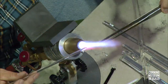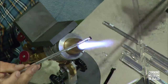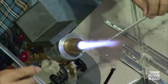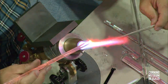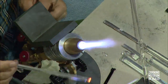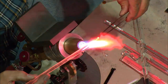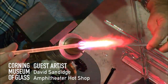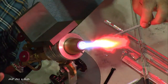You're probably going to want some graphite plates for your tabletop. You definitely want a fire retardant tabletop. This is just Hardiebacker concrete board. Doesn't take a ton of money. You're going to need some regulators for your gases. Those are maybe $100 each, one for your gas or your fuel, so either propane or natural gas, and you'll need one for the oxygen, the accelerant for the flame as well. You're going to need some gas hosing to be able to connect everything. There's another $50 or so.